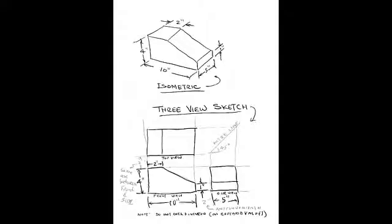Then the side view becomes the view to the right of that, and we fold that out like a book that's facing away from us, as if we're looking at the back cover, and we fold out the front cover as the book faces away. If you rotate the book so the back cover is in front of you and you fold out the top view with the front cover of the book, that shows you how that top view looks. We then separate those by the same dimension, not required, but good practice.